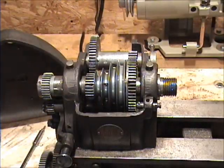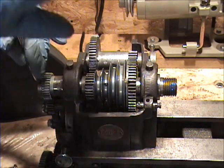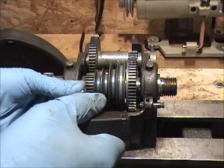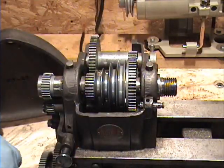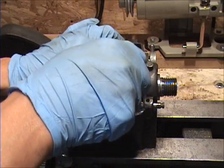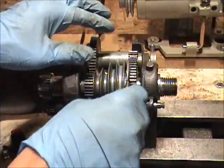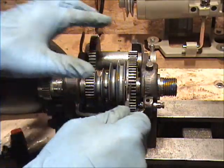On my 618, there are three set screws. One here, which we'll loosen. Then there's one right here, and we'll loosen that one. And then the third one is on this bull gear, and it's the one that's down deep. That other one up there is to lock down a pin in here. So there are the three set screws: here, here, and down in there.